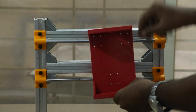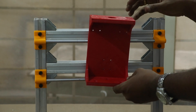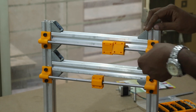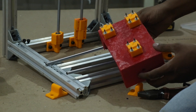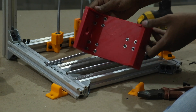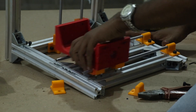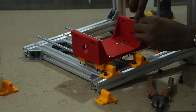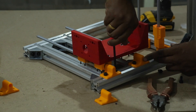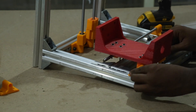Now I need to attach the main X-axis housing to the smooth rods and bearings, and to do this I have to remove the smooth rods. These aluminum extrusions were getting in the way so I had to do this. I wish I had the right length of allen key bolts because I don't like them protruding so much — I can replace those later. Now I can slide the X-axis housing to one corner, tighten the smooth rod holders, and then do the same on the other side. This way I can be sure that both rods are parallel.